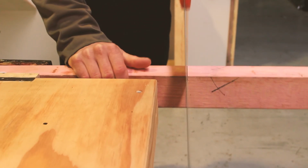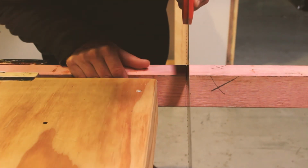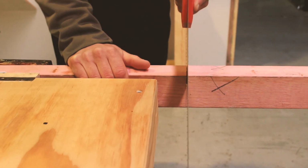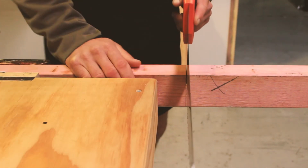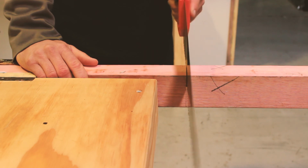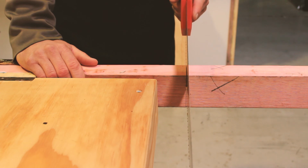It's starting to feel good. So I can see that I need to angle the blade very slightly back this way, and now I'm on form. That's cool. So I've made 20% of my cut here, and it's pretty hard to deviate from this trajectory. So this trajectory is established, essentially. It can move, but you're not going to get a square cut from that point onwards. So if your trajectory is correct, the rest is pretty easy.